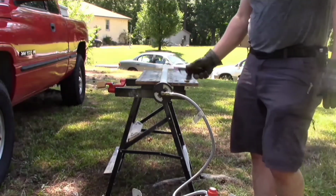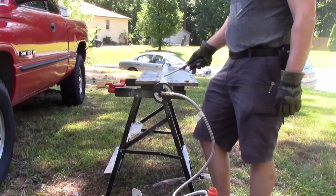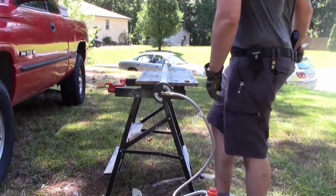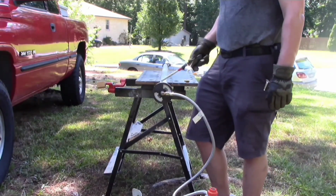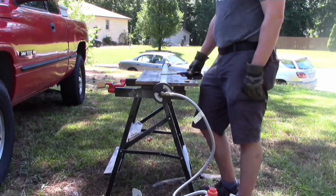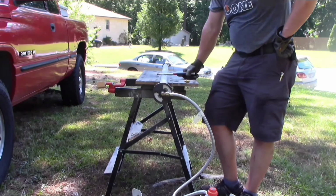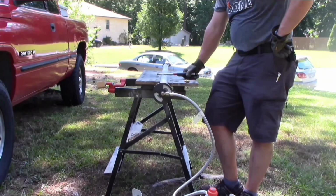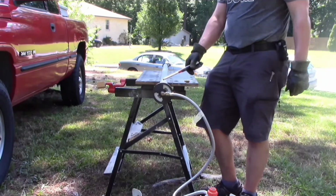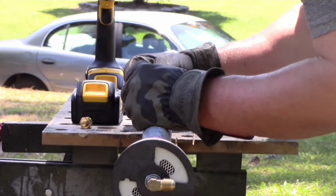So the way my dad decided to fix this, and the way I'm going to have to do it too, is even though the whole point of doing this with the cutter, with the angle grinder, was to not have to drill a bunch of holes, I'm going to have to drill a bunch of holes in it. Not nearly as many as when my dad built these the first time. He drilled 700 holes in the iron pipes that made the burners. I'm not going to drill 700 holes, but I am going to have to drill maybe 3 holes in between each cut.